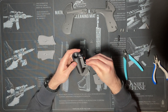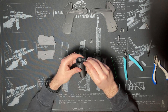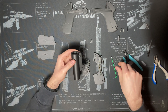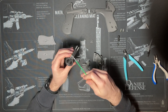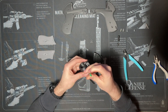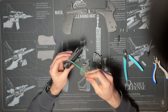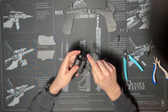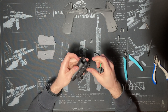Length is not critical as long as the screw does not come out on the other side of the barrel assembly. Do not over-tighten — screw it in until it is flush with the surface of the barrel and make sure it lets the extractor slide freely in and out.